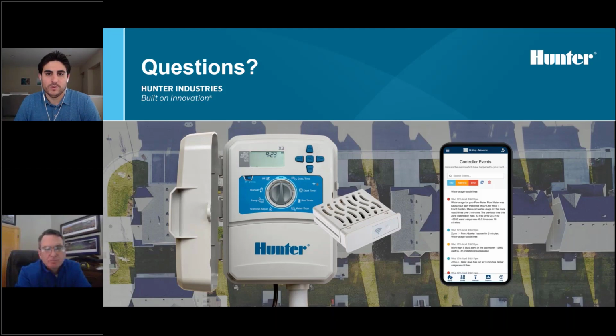I think you mentioned there was another question earlier about if the smart ports come with the controllers. It's kind of funny. We at Hunter here, we've gone back and forth on that. Some of our older controllers used to come with the smart port in the box. Others, now we don't include the smart ports. Some of them, like our HCC and ICC2 and bigger commercial controllers, have the smart ports pre-wired from the factory. We kicked the tires on that option back and forth either way, but ultimately, right now, we don't include the smart ports with every single controller, but they're pretty affordable. I think it's like, I don't know, $12 list price for a smart port, and you just wire it into those REM terminals and connect the remote, and you're good to go.